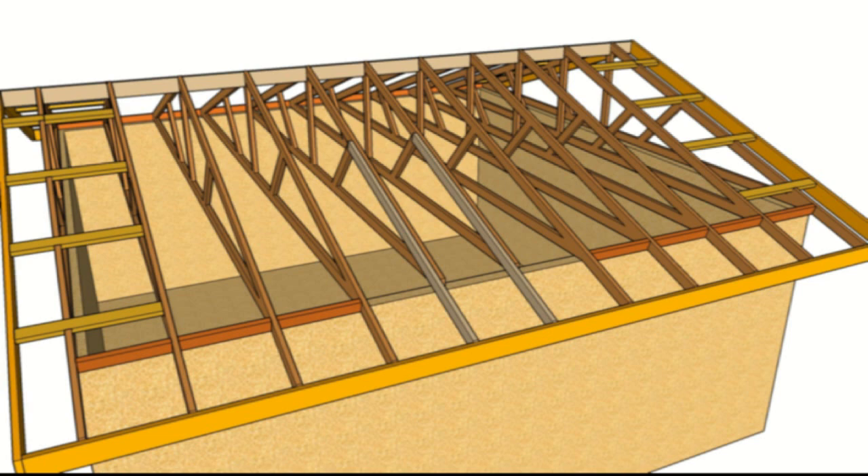When you get the rafters in, how long should they be? Realistically you could go with a regular cantilever overhang. If you have a two foot rafter overhang, then you want to be at least six feet, but you might need to go a little higher and use a longer board. In the attic you're not going to be able to nail at the bottom of the rafter, so most of the nailing will take place at the top. You might actually need a 12 or 14 foot board. You should nail at least six nails, and if you can stagger your nailing 16 inches on center or 24 inches on center and nail along the entire truss, that would be great. This is something you're going to have to pre-plan and put a little thought into.